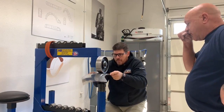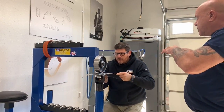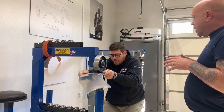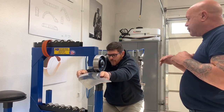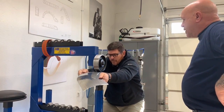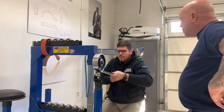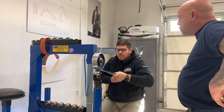And as we're using the flat top wheel, you can see that the shape is starting to flatten out on you. The shape of the panel is becoming relatively less crowned, doing the opposite to what you want. But in actual reality, you're putting shape into it because you're linear stretching as you're running backwards and forwards through the wheel.